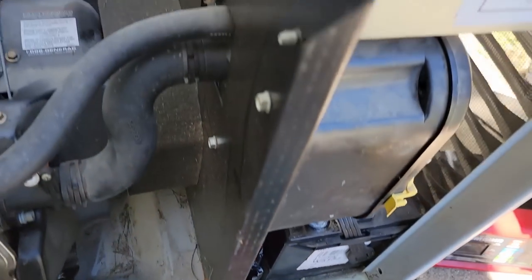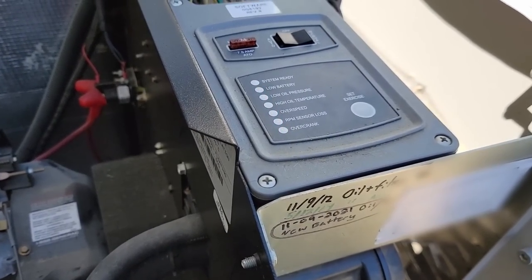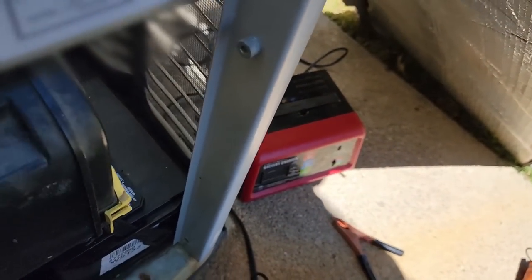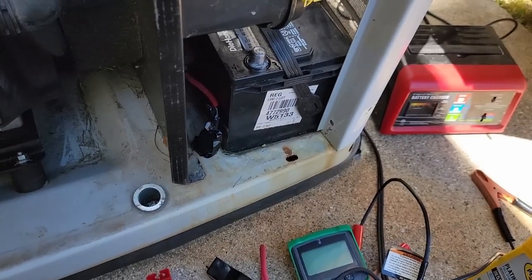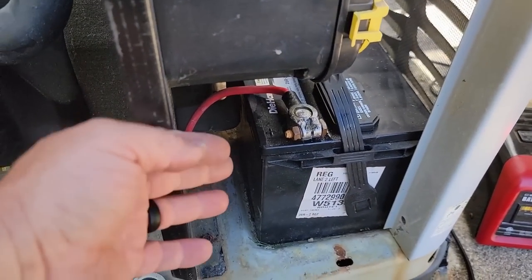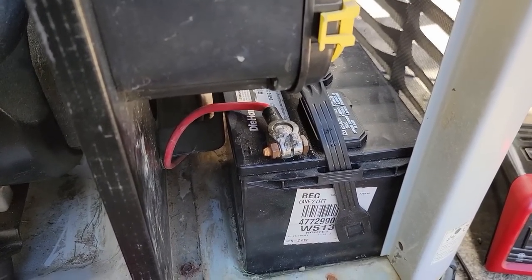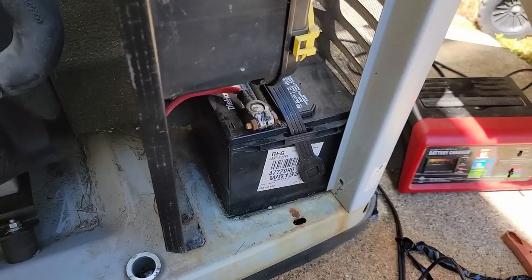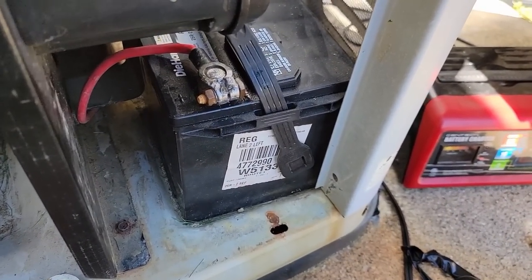That 10 amp there did pretty good. I'm going to go ahead and just have him running off that other one. I don't want him having to take it all apart. We're close enough now that I think it's going to hold out fine. If it was completely dead, I don't think I would want it to do it. If it was mine, I'd probably let it go on the charger there. But they paid you to come out and do the job, so let's see if we can do as much as we can — plus that allows us to set the timer and everything else. Obviously you don't usually unhook the positive because if you're wrenching on it and you hit ground, it's going to cause a direct short, which could basically blow a chunk of metal in your face — which is generally why we undo the negative. Went ahead and got it hooked back up so I don't have to worry about him making that mistake. The liquidy looking stuff down here is silicone dielectric grease that the last guy put on there to help try to keep some of the corrosion off.